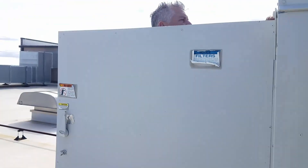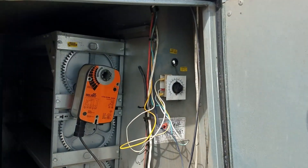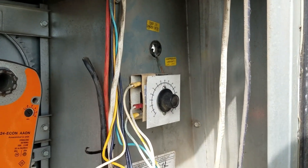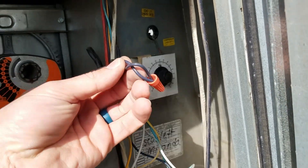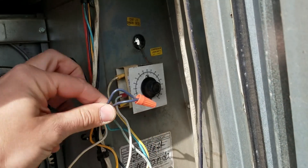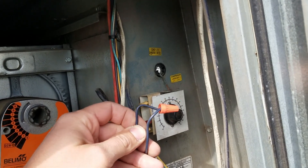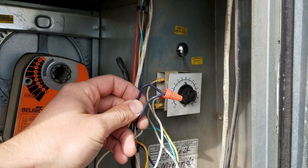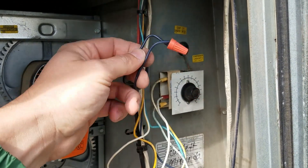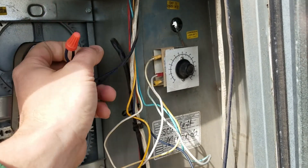There's your refrigerant bulb — that's the dry bulb for the compressor lockout. One trick we figured out is to use the compressor lockout dry bulb as the changeover and forget about the enthalpy. These two black wires are originally plugged into the compressor lockout; they are the circuit for the common side of the compressor contactor, so the compressor lockout cuts the common circuit of the compressor contactor.